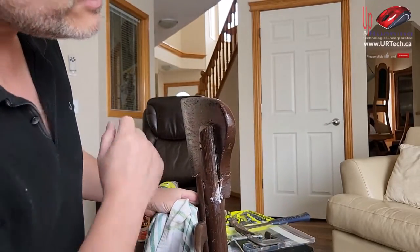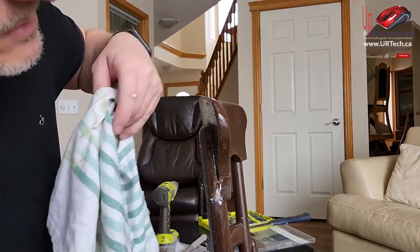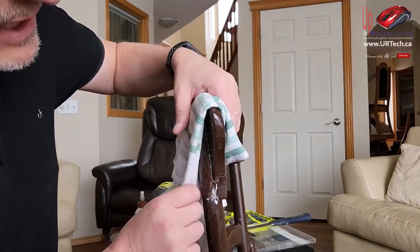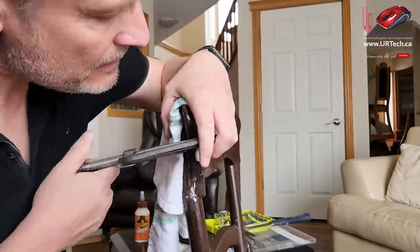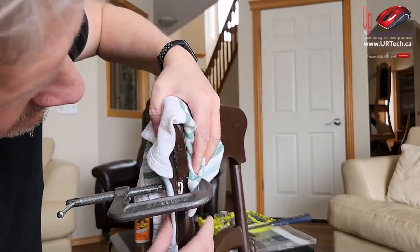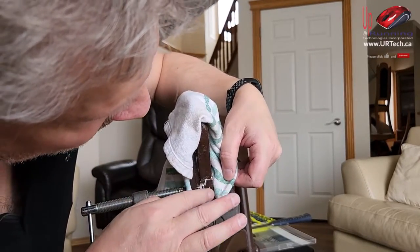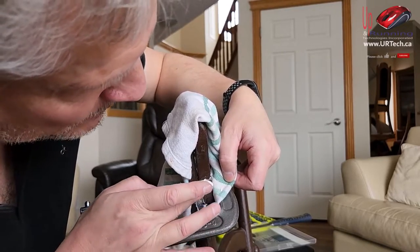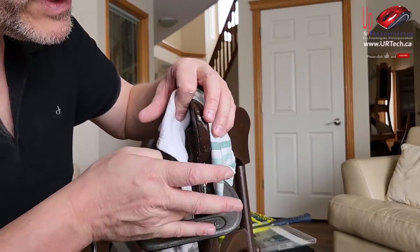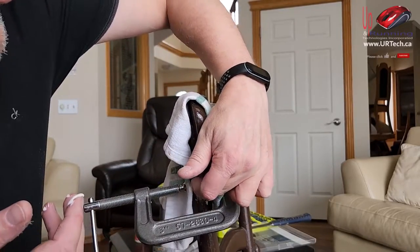I can see from cranking down the other side that this has come loose a bit, so I'm going to crank it down again. I could use a number of tools but I'm simply going to use a tea towel — yes I have rubber pads but a tea towel works just fine. There — that's squished all the way in. It's got glue coming out, and that's good. Because this piece is really falling out, it's really a separate part from the general repair, so I'm going to leave the clamp on this one. This glue will just come out and you want it to be oozing out if you can.